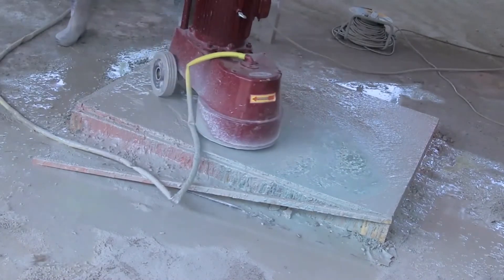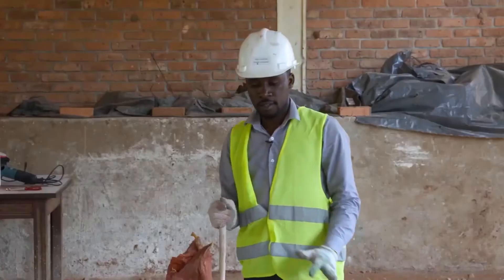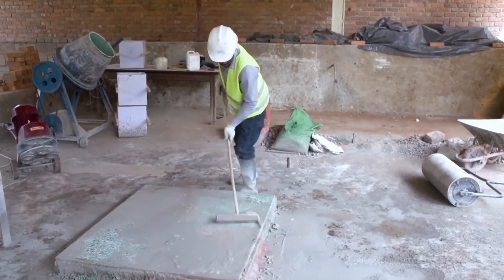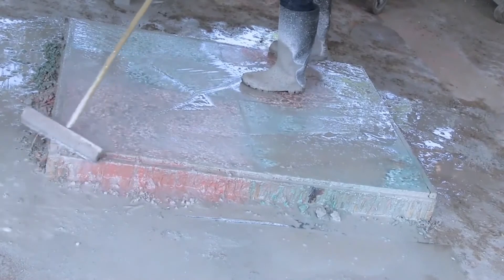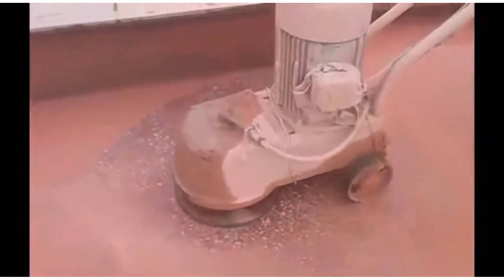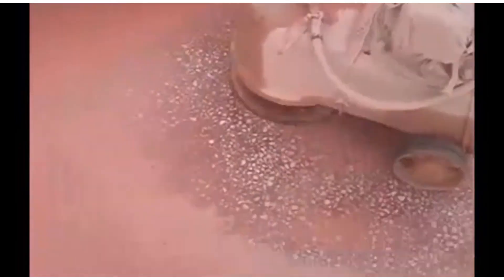Section 2.3.3: Methods of Grinding. Method 1 — Wet Method: water is required to cool the diamond grits and clean the dust formed during the grinding process. In this type of grinding, water acts as a lubricant, dampens friction, and extends the life of polishing equipment, particularly the discs, which can melt due to high temperature. Method 2 — Dry Method: the tool is featured with a separate provision to retain dust within a cover, leaving no mess behind. You can use both types of grinding to get the finest and desired shine — initially try dry grinding, and finally the wet process to clean and finish the floor completely.